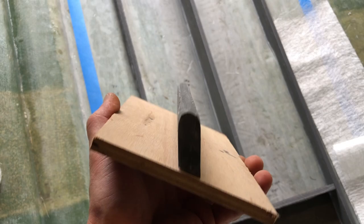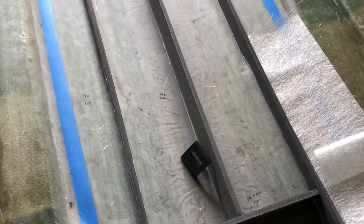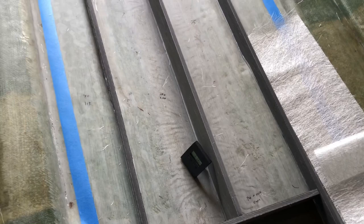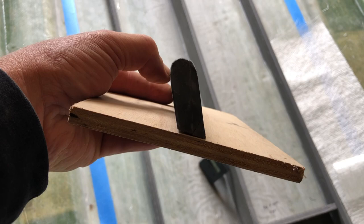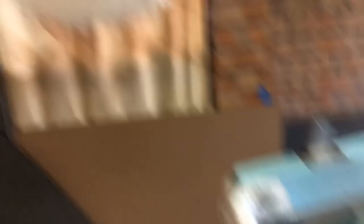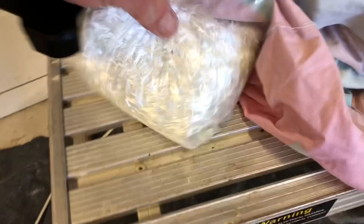I just want to make sure that the glass I'm using — I've got 450 chop and 450 double bias — to laminate these stringers in. And obviously, peanut butter mixing the corners together, little cove. I'm just not sure it's not going to delaminate in the wet state off these corners when I wrap the top. Got my strips of chopped strand ready to go, and a bag of all the rolls of double bias ready to go on these stringers. I'm just about to mix up some peanut butter mix and cove the corners.